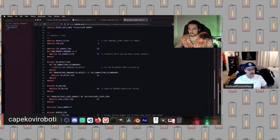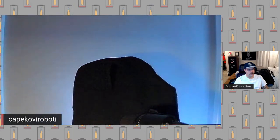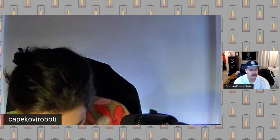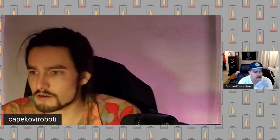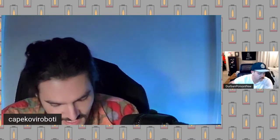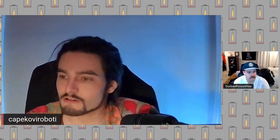And so let me switch back to this camera for a second. So if I just grab a random board, what did I grab? This is an SKR 1.3 board, right? So I've got my SKR board here. If I set my pins incorrectly, then it will try to use the wrong section of the board, right? So this pins file is very important.